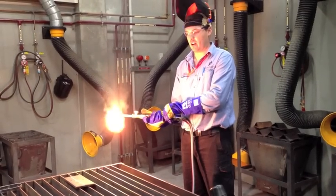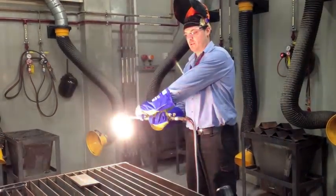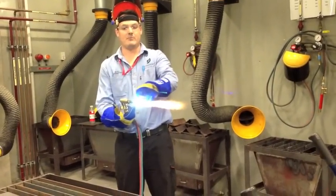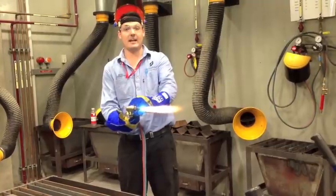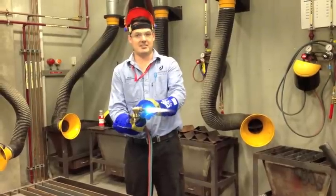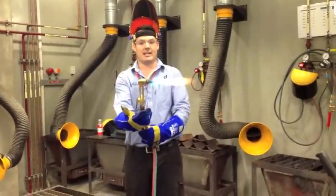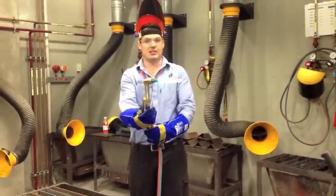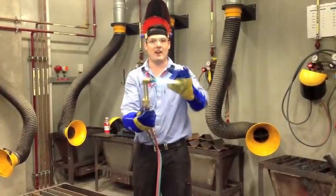However, we don't want it to be too quiet either. So we turn it down a little bit, then we turn on our oxygen. The main thing you're looking for here is that neutral flame through the middle. We want to get rid of that feather, just like that. And then when you bring in your oxygen, you can see it goes through the cone. When you're looking at it like that, that's when you're ready. When you stretch it, the two flame lines run through the same — you'll notice it's very consistent.